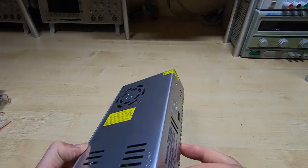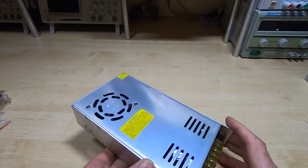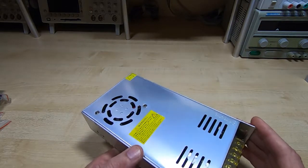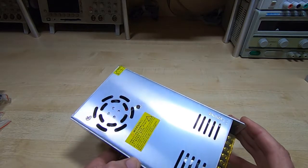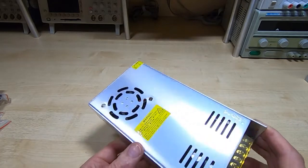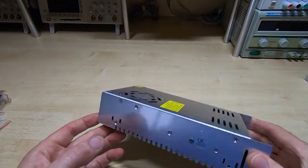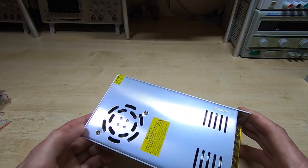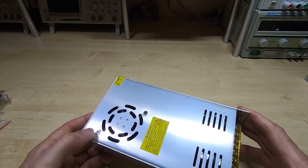Now of course there's always a danger doing this, in that the designers in theory have worked out a careful airflow pattern based on the fan location. But what I'll do as usual is once I've got the thing assembled, when I'm testing it, I'll fit some internal temperature sensors and make sure that it's not overheating. So first thing I'll do is take the cover off this. We'll have a look inside and see if it's going to be reasonable to use this within the supply, and also whether or not it's going to be feasible to run it without the fan and the top plate fitted.